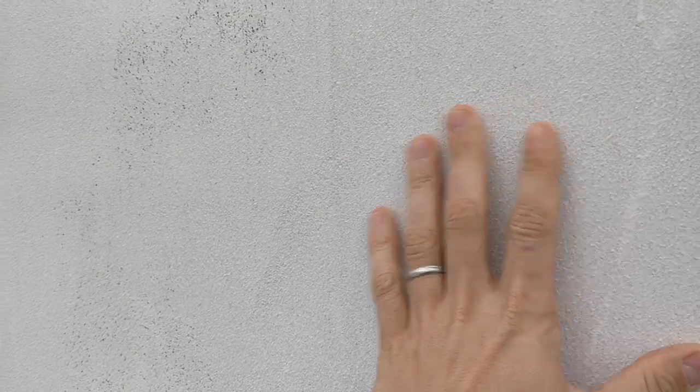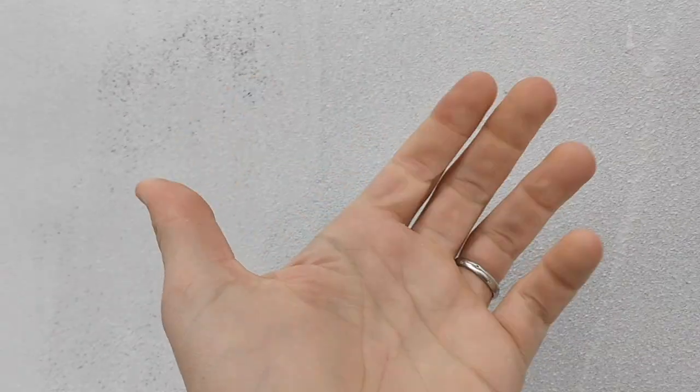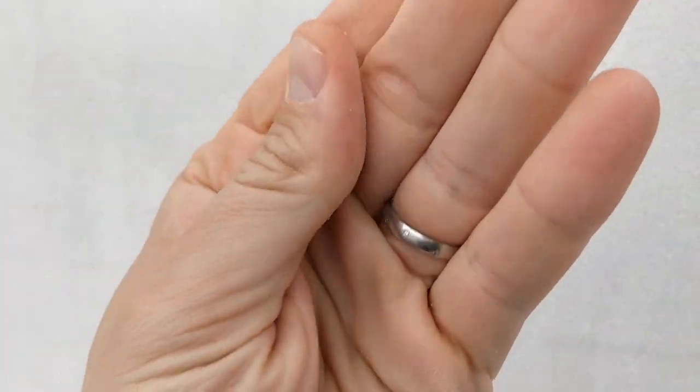And this acrylic primer, Albert, does this help the stuff to stick on? Yeah, it does. If you feel it, it's got like a quartz in it. Oh wow! That's really grippy and rough. I thought it was just like PVA or something. It's a fine quartz. That texture is so odd. You can see it even leaves little grains on your hand. Is that what makes it dry so quickly as well? Because it's not tacky at all, it's just so grippy. Yeah, it just gives you a lot more key. To hold, of course. That's great.